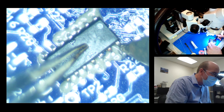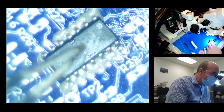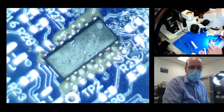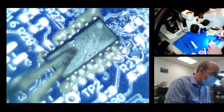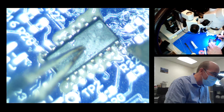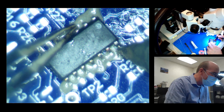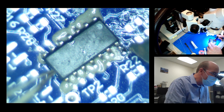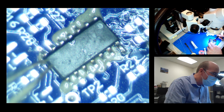I'm going to put my iron on this tip here. You see how the solder stays localized to that one little region — all the little solder balls coalesce like the T-1000, and nothing else around it melts. So I could still move the part if needed; I can reapply heat and readjust because I only allowed that one pin to actually melt.